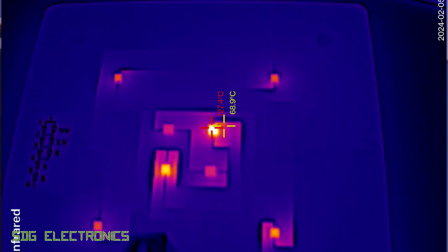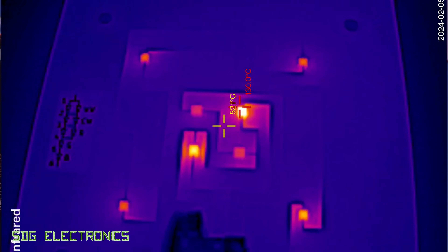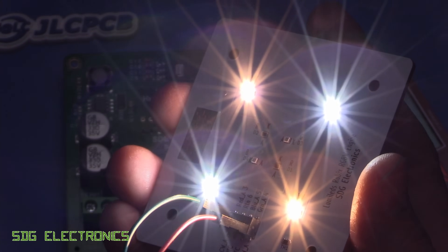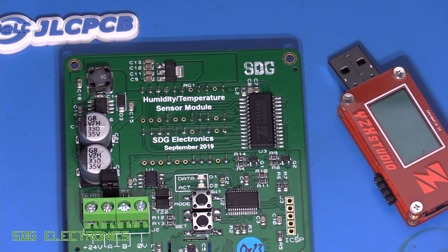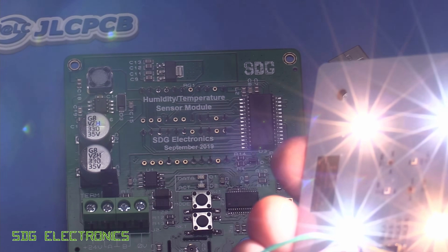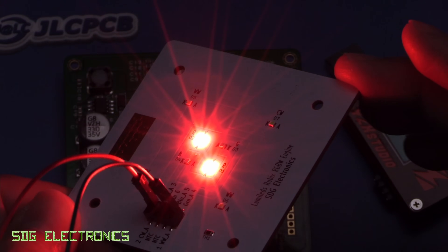Let's see if it does the same thing on the other board — maybe there's a little bit too much paste causing too much thermal resistance. And again that green LED is climbing very rapidly, already up at 128 degrees C. That's a little bit too hot for my liking. I think if we were to use these particular LEDs in the design it would be safest to double up at least on the colours if we want this kind of brightness. Here are the white LEDs — the warm white and cool white together at about seven and a half watts, giving off loads of light. The colours are really quite nice; I think these were both CRI 90 LEDs.